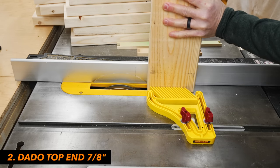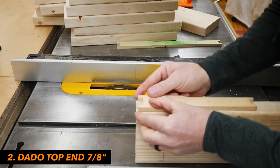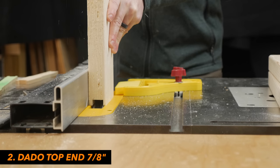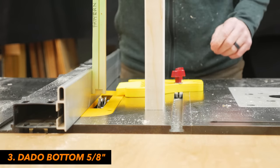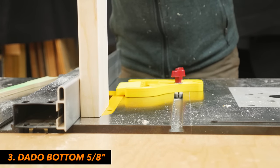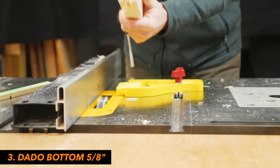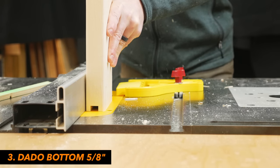This is definitely not a traditional table saw cut with a dado blade, but just take it easy with nice steady pressure and let the blade do the work. After that first cut, check it against a factory Langstroth frame to make sure everything lines up, and make adjustments before sending all your wood through. After all pieces have the seven-eighths cut done, change to a five-eighths dado blade and send all pieces through for the bottom notch. Check the blade height with a factory frame, and make sure the cut goes right down the center of that block, because we'll be taking material off the sides in step six.